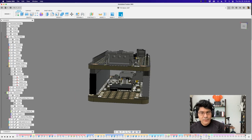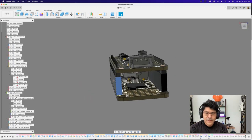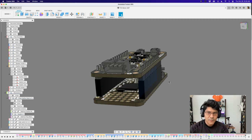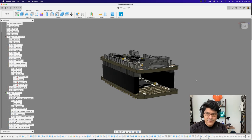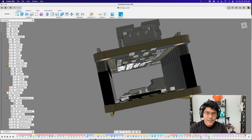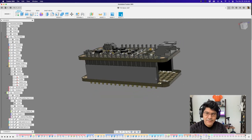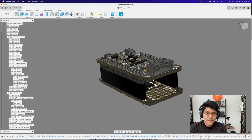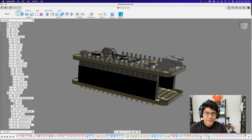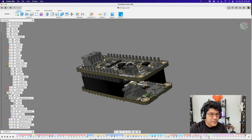The Feather M4 has female headers — these are standard size. I stayed away from low-profile ones because most people will use standard headers and I tend to have more of them on hand. If you have space constraints you could swap to a smaller profile. Standard headers also give more clearance between the two boards, which is beneficial when you have cables running between the two PCBs. The Prop Maker Feather Wing has male header pins soldered to the bottom and simply snaps on top of the Feather.